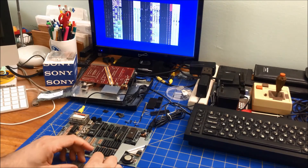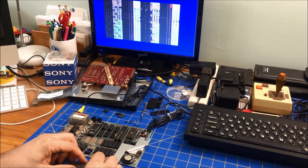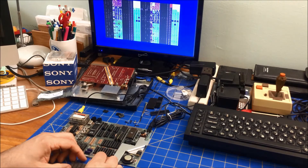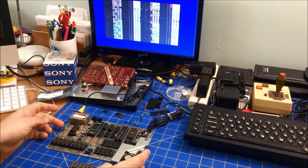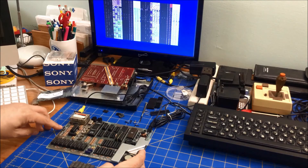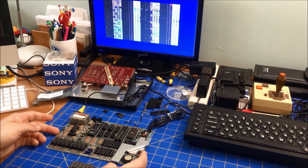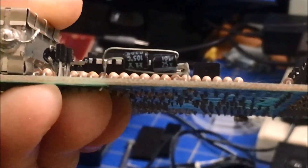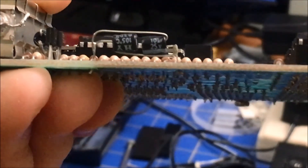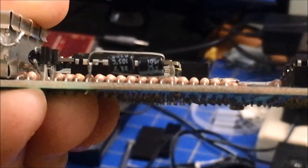If you have any comments on this, thank you Dave from Dr. Dave's Diversion for sending me the ULA replacement, because it's going to come in handy — these things do break. I'd love to get this Spectrum working. I've done some interesting work — I didn't have the right capacitors so I created opposing caps, two capacitors facing each other in series to get the right microfarads.